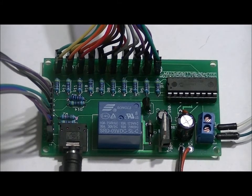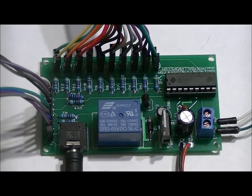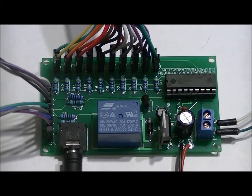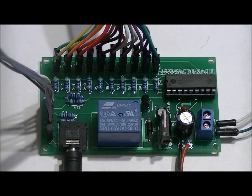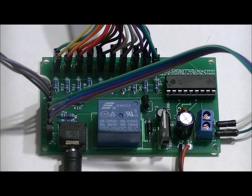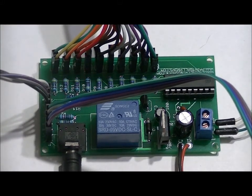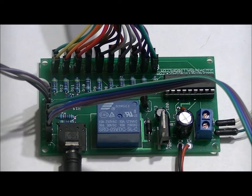This is the siren connector — simply remove it or pop it into place. Right here is where you connect your buttons. Each button has four wires; if you want to disconnect to mount, make sure you note which wire is connected to which pin rail. Each pin rail has four labeled pins: L-, L+, B, and B. L- is the negative of the button LED, L+ is the positive of the button LED, and the two B pins are button pins — when those are shorted together by the button, that sends the signal to the processor.